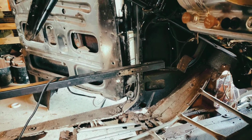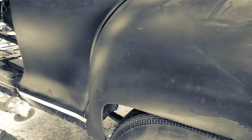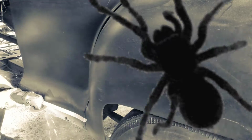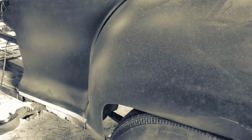But I hate breathing in the paint fumes of the paint melting if you don't grind off the paint good enough. Sometimes the garage fills with it, but you're gonna see what I'm talking about here. You can just tell by the dust. This is all Bondo. It's legitimately about an 1/8 of an inch to a 1/4 inch of Bondo, which is normal. You see that on these old cars because that's how they saved them, just made them look presentable. But yeah, that's all Bondo, no metal there. It's wild.